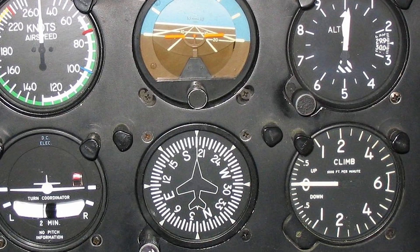When we talk about glass, it's EFIS — Electronic Flight Instrument System. Any time you put EFIS in a certified aircraft, it requires an STC. You can't just go buy a G5 and put it on your plane as a minor alteration. It has to be certified to work in that specific make and model.